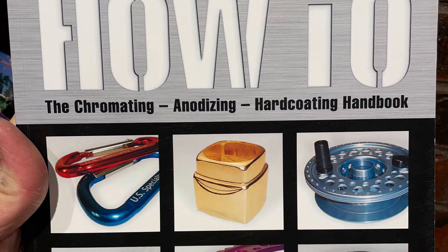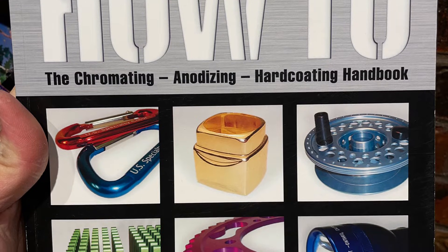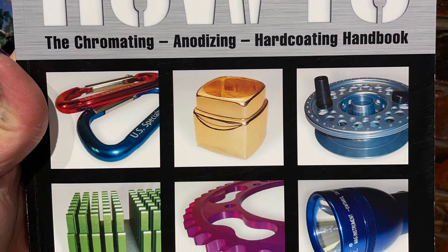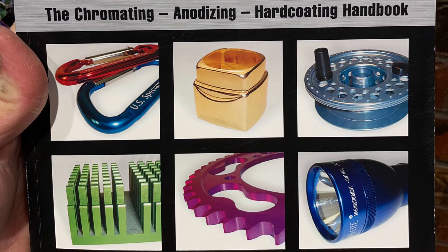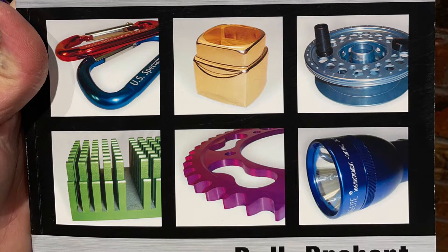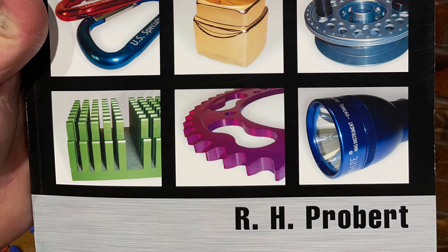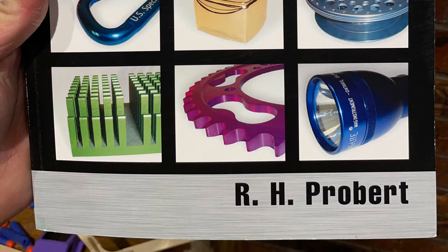This book was about $100 and it really distills everything you need to know into a fairly short but extremely detailed book. The only thing I'm doing differently from the book is LCD anodizing, which requires less power, weaker acid, less cooling, and has lower fumes — it's basically safer and requires a bit less equipment. It does mean your acid concentration needs to be held within a different range. I'll do a separate video on how to do an acid titration to measure the acid level and dissolved aluminum content in your anodizing bath, which is really important for consistent results.